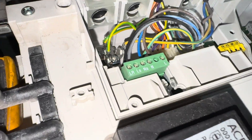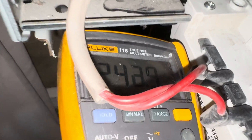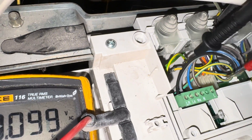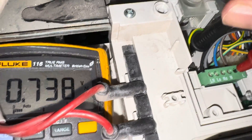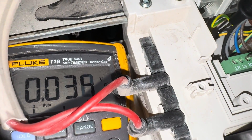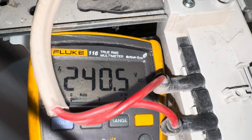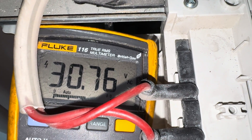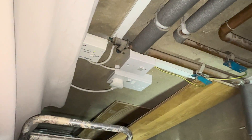Let's test to make sure we've got voltage everywhere. Earth against live - we have 240V. Neutral against earth - we're looking for 0 to 15, which is perfect. Live supply - we want 240, we have it. Live return - we want 240 but we've only got 30 volts, which means that receiver isn't sending the correct power through.